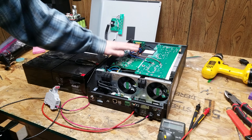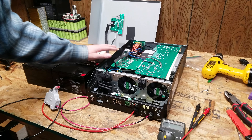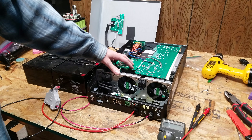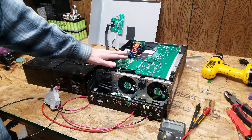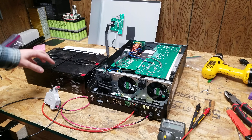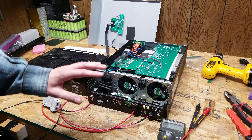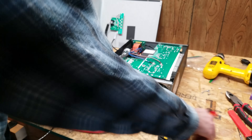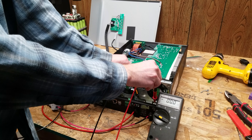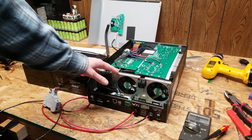I got this entire inverter put back together and it was actually quite a bit easier than I thought it was going to be. All the little connectors are nicely labeled as to where they go, and I was able to reference my disassembly video if I had any questions. I did run into an unfortunate problem though — I'm not going to be able to turn this on. I have a small lead acid battery bank over here: four 12-volt batteries wired in series to reach 48 volts, and a fuse holder, all set up to try turning it on. But doing some last-minute checks with my multimeter, I noticed it's reading a dead short across the battery input terminals of 0.0 ohms. Something else must be wrong in here that I missed while troubleshooting.